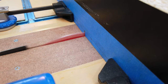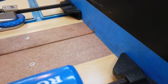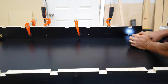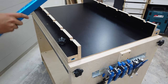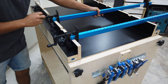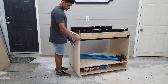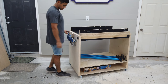I decided to make the clamp racks first, using my crosscut sled to make some dados. I used Rockler clamps to hold it in place while making the cuts, then tested the fit. I attached it to another strip using drywall screws and used star knobs to attach it to the T-Track. With that, the flip top clamping cart is done. I use side A for assembly, clamping down stuff, and sanding. The other side I use for glue-ups — cutting boards, doors, panels, you name it — and right now I'll show an example of gluing up a tabletop.